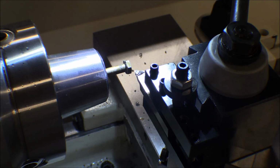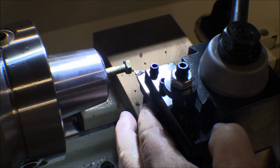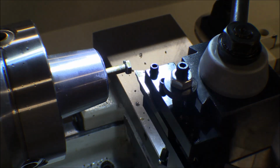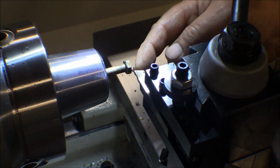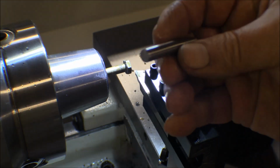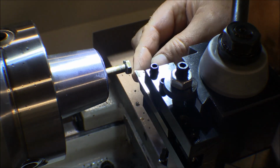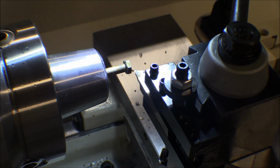I've been using that little 6-inch Craftsman 109 lathe, and I got bits and stuff for it. So I got to looking through there, and I've got some 3/8 steel bits. I got a bunch of them out actually, but I took one of them and put it on the grinder and ground the shape on here for cutting, and it didn't do a very good job on it. My grinding stone is out of shape, it's out of whack, and I was looking for my wheel dresser and I couldn't find it, so I did the best I could with what I had on there. And I used this already for this one, for the head on it, and it worked okay. It's sharp enough, and the angles are okay, it's just not quite what I want.